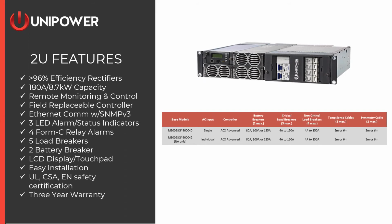You have a choice of 2, and the difference really is just the AC input. Is it a single bulk AC input, or is it an individual AC input to feed all 3 rectifiers? Primarily in North America, you see the individual rectifier feeds. Outside of North America, the rest of the world, you'll see the single bulk. So it really is customer preference. From there, you choose your controller, your battery and load breakers, and cables appropriately.